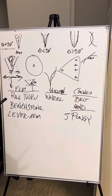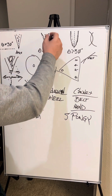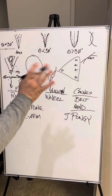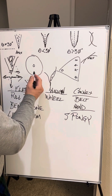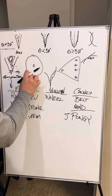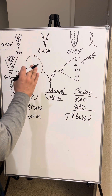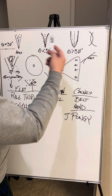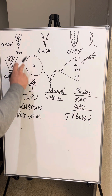To recap: flat, concave or hollow, and convex — parabolic, hyperbolic, or what have you. These come from grinding wheels and grinding stones historically. Flat grinds and hollow grinds were very common for a long time, while the convex was less so — except in places like Japan, where there was a tradition of convex edges.